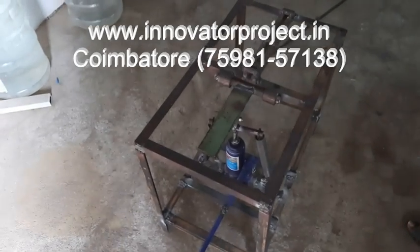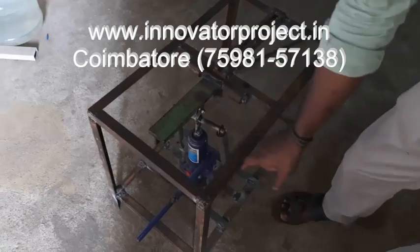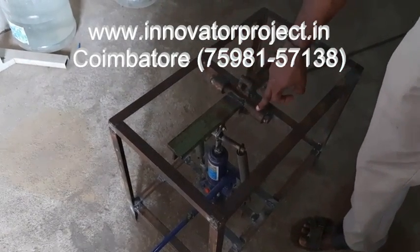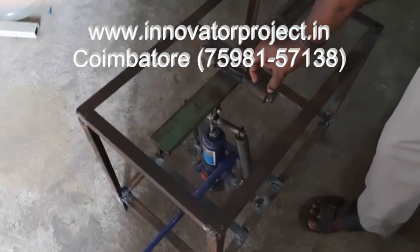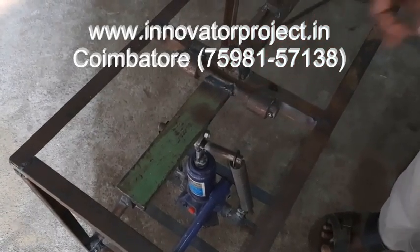Hydraulic TMT rod bending machine. So this is the frame, a frame model made of mild steel L-angle. This is a guide bush, 30 mm diameter, length 45 mm. This is a shaft, 20 mm diameter mild steel shaft.